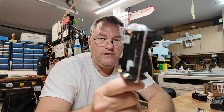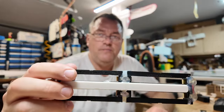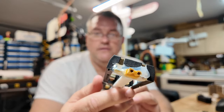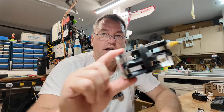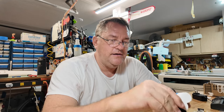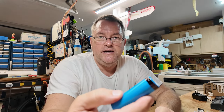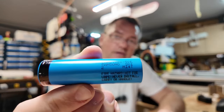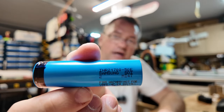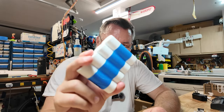I build them in not only the 4S-1P design I showed you here, but also a different 4S-1P design for narrow-bodied airplanes with an XT-30 connector, and then also a granddaddy 21700 case. The 21700 batteries I'm flying for some of my larger airplanes — that's a Samsung 5000 milliamp hour battery there — tremendous capacity for model aircraft.